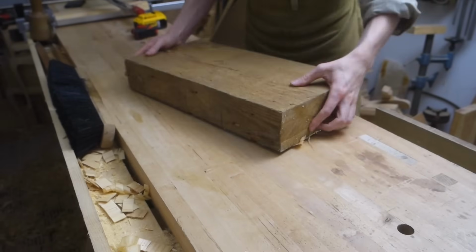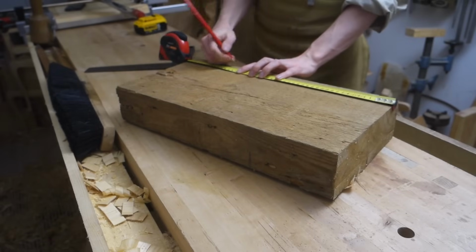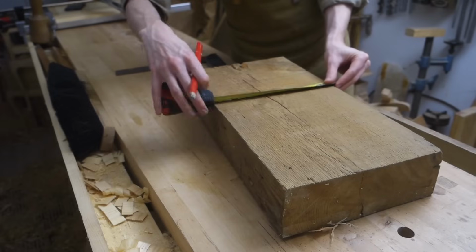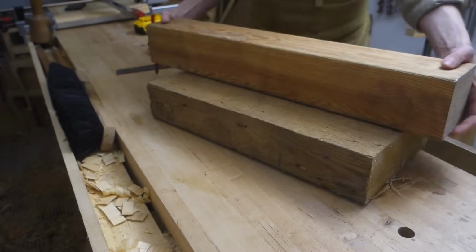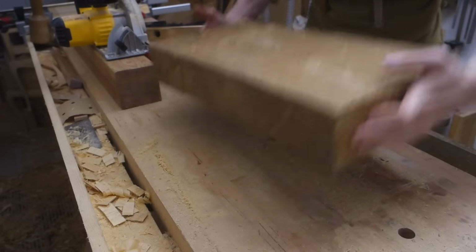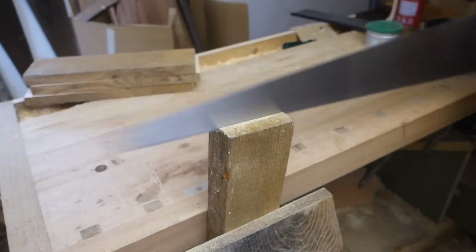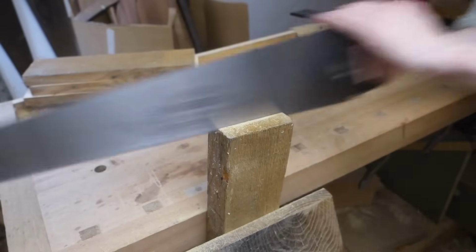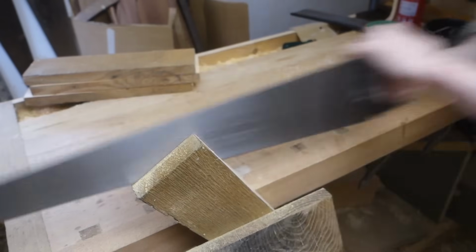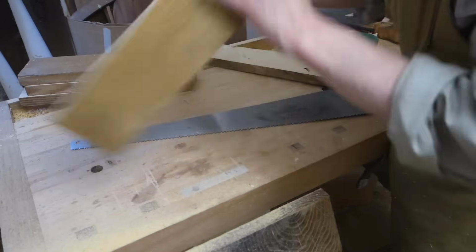With the tops in place, I moved on to the drawers, and this chunk of pine will become some quarter sawn drawer sides. I removed the center, which contained the pith, and resawed the outer parts. I then marked the center line on the resulting pieces and resawed them again.